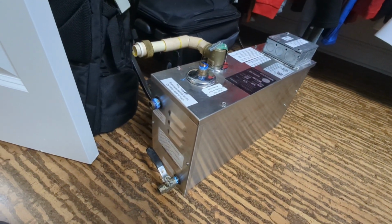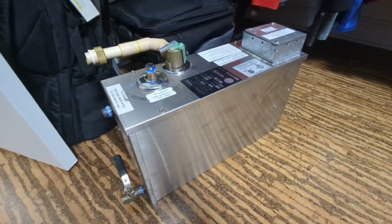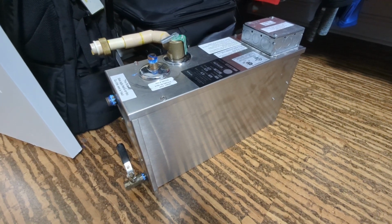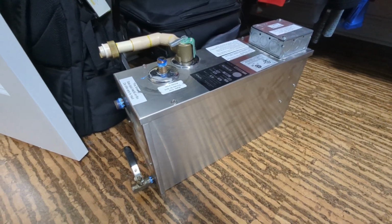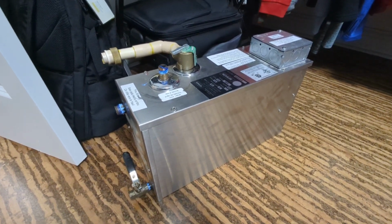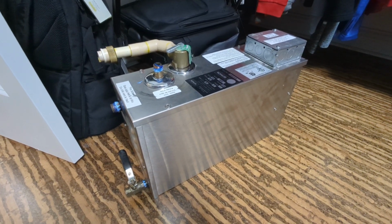So the temperature fuse would falsely cut off the unit about 30 to 60 seconds once the steam got up to temp. It would cut it off because it was sensing a false condition and protected it. Now, as far as finding the temperature sensor for this unit, I've reached out to Thermosol, and good luck. They'll do one of two things.